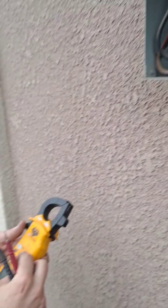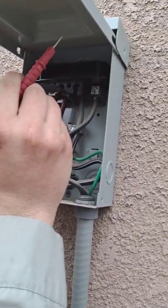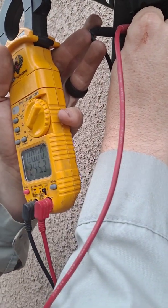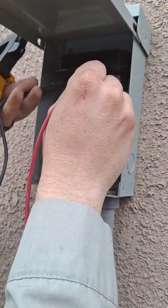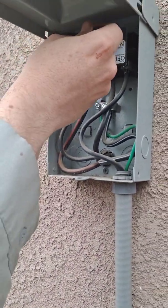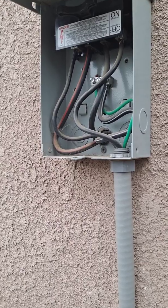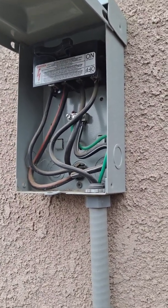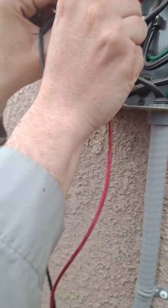What you're going to do is turn your meter to volts and put your leads on the line side across the two, just like you would with that contactor from the previous video. You'll see we're getting 240 volts coming out of that. Now because I have this disconnect taken out, you're not going to have voltage over here on the load side. But if I were to take this disconnect switch and put it back in, it will engage the current and allow voltage through it — as you can hear, the system just kicked on. Now if we put our leads to those loads right there, you'll see we get 240 volts.